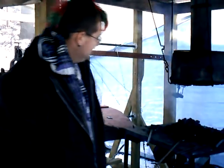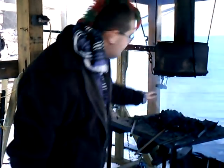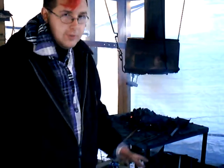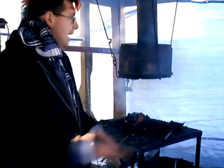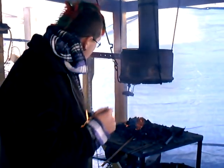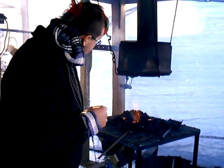All right, without further ado, turn the air on and we'll get started. Now this is bituminous coal in here — I usually burn anthracite, but a friend of mine gave me a couple buckets of bituminous coal. I grew up with bituminous coal, I was using it for years, and I missed it — I missed the smell. The true blacksmith smell right there is that bituminous coal and sulfur burning off of it. As you can see, I've done some really good coking right here.